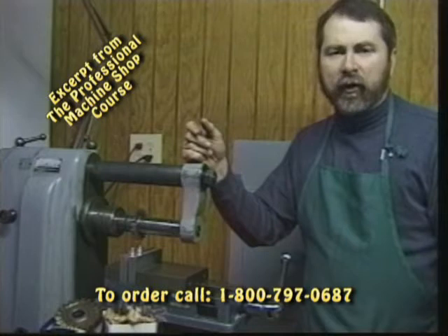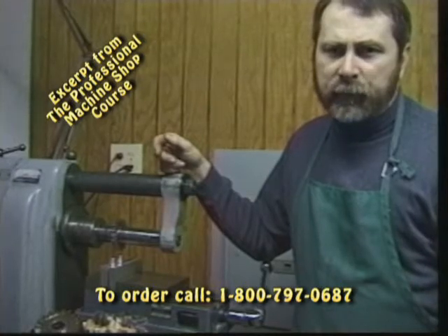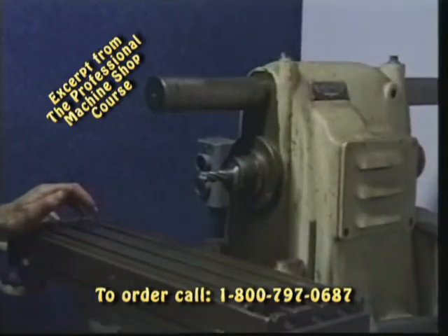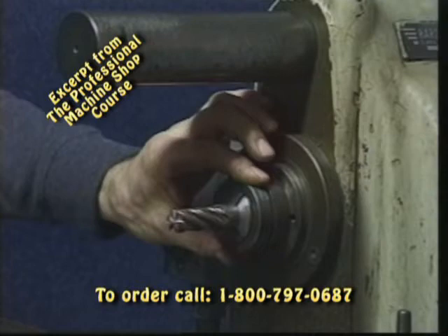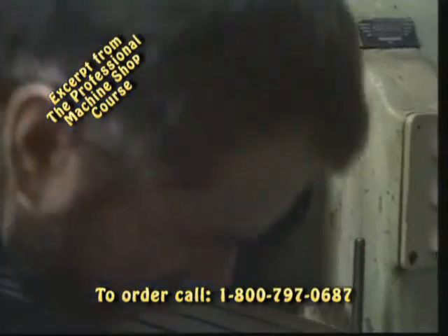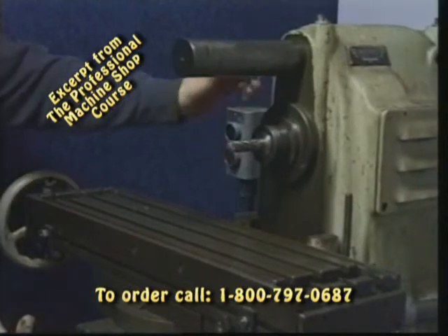Having a little horizontal can fill the gap in a machine shop for little specialty parts. Let's take a look at another one set up in a different mode where we are using a conventional end mill in a horizontal position. This is a second machine set up a little differently. You'll notice we've got a conventional end mill mounted in a 5C collet. The little Hardinges are versatile in that we can use them in the overarm method with a conventional horizontal cutter, or we can reverse the overarm bar, take off our arbor, and replace it with a 5C collet of various sizes to accommodate a conventional end mill for special application machining or surfacing.